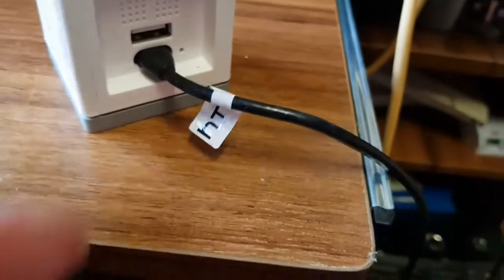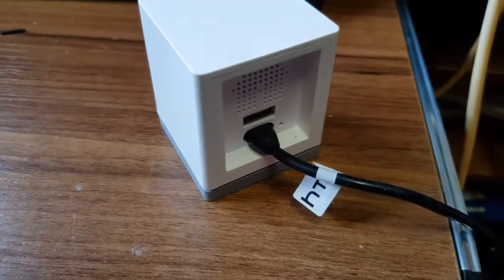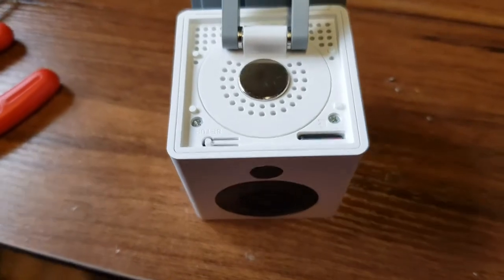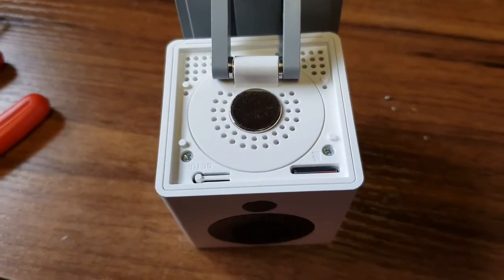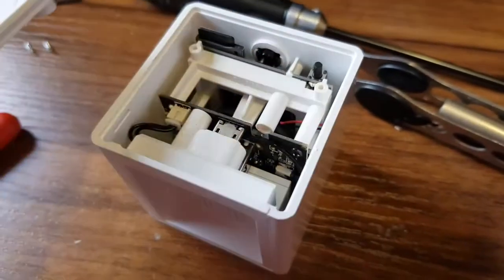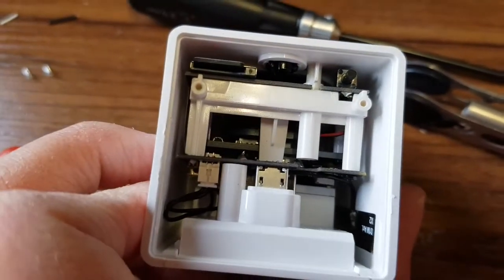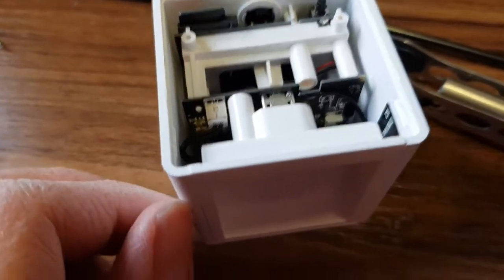It's a very quiet hissing noise and pushing the reset button does nothing. So we'll take it apart and see what's wrong. On the underside of the unit there are two screws. I've removed them and had to pry the plate off — they've got plastic clips that clip into little lugs around the edges.